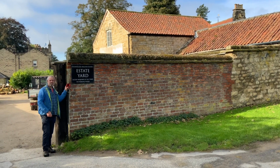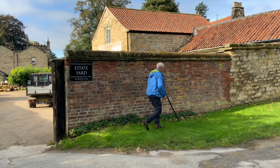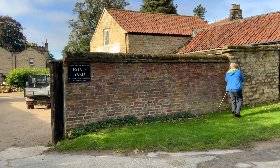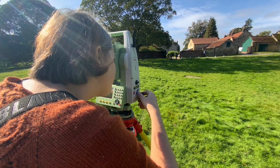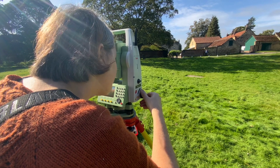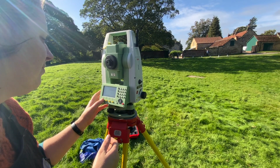1.461. Try to be efficient and economical with where you place the points, but don't be too frugal or you will probably regret it at the next stage. Your control network can include building corners, foundations, gate posts, drain covers and so on, and these can also contribute to your detailed survey so that you kill two birds with one stone.